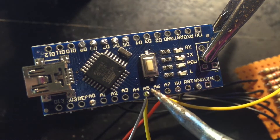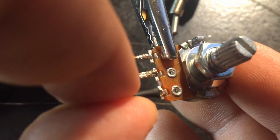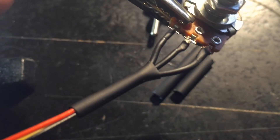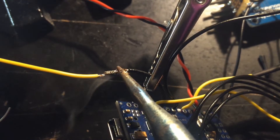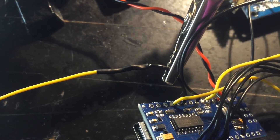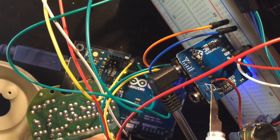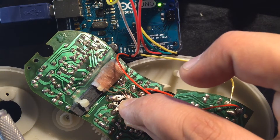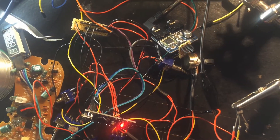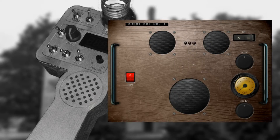Soldering together all the parts is a little fiddly, but if you solder piece by piece you should keep track of what cable belongs where. I shrink-tube all the connections as my housing will be pretty compact later and I don't want things to short out. I am not showing you in detail how I hook up the little shower radio amp, as yours might look totally different anyway. I simply soldered the radio output through the amp's input, unsoldered the volume potentiometer to extend the cables for an easy fit into my housing. And there you have it — the next main component of the ultimate ghost detector is finished.